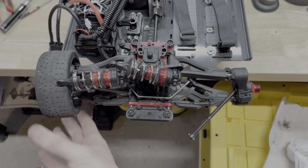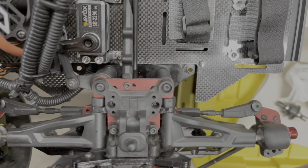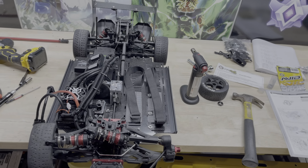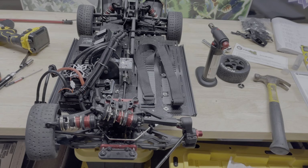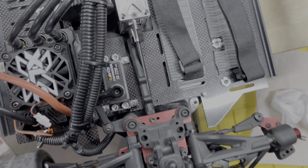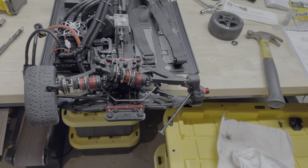I am here working on the front, and luckily, in order to get the cup out of there, for the rear I had to put some heat on, put a hammer on it, but I also had to take the rear off so I can turn it in order to get something in there to tap that out. For the front, same thing, it was seized up, but I was able to use this extension plus one of these and heat it up like this and avoid all the plastic and tap that out this way. So that was good.